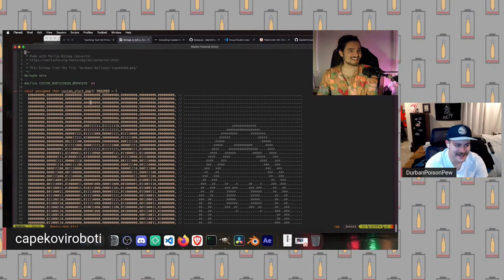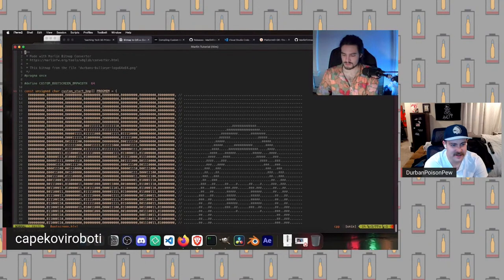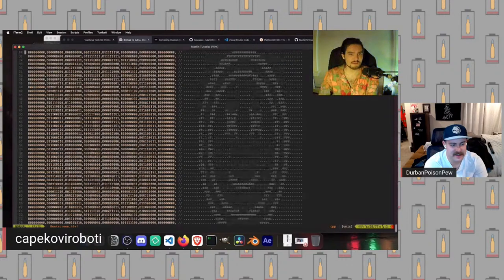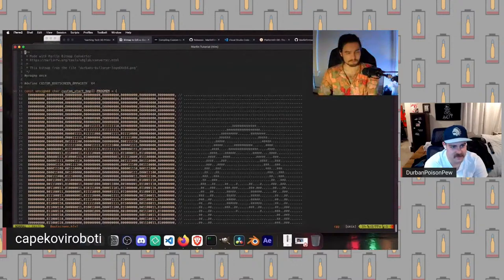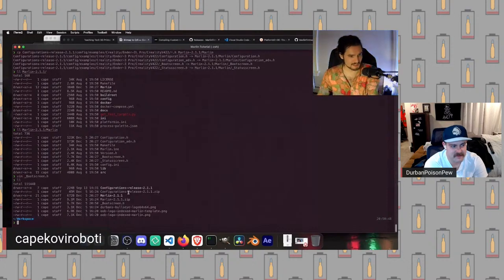So yeah, here you can see our nice little image over here. We've got the X's for eyes and a smiley face here. And we're just going to save this file. So now we have a new file called bootscreen.h right here. And we're going to replace our old boot screen file with that. So we're going to do bootscreen.h